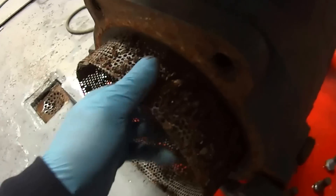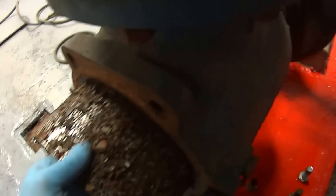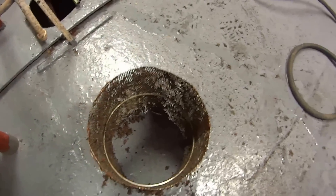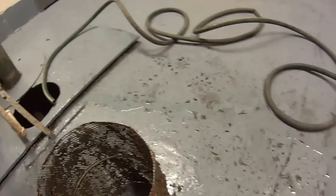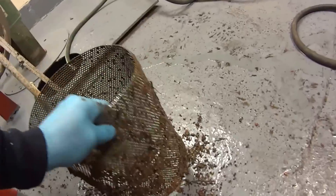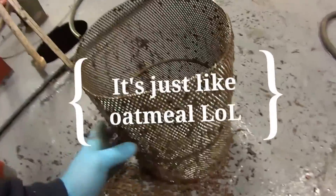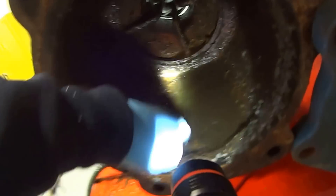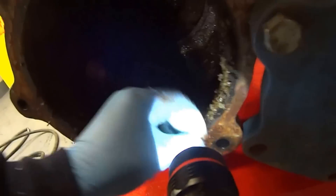Take a look here. You see that? That's dirty — that's bad. Let's bring it up to the light and take a look at it. This is why you have to pull the strainer — see that right there? I'm going to clean all that stuff out. Even my drain is clogged. I'll get all that stuff out by hand, just drop it on the floor and clean up later. The strainer itself is pretty clean, not bad.